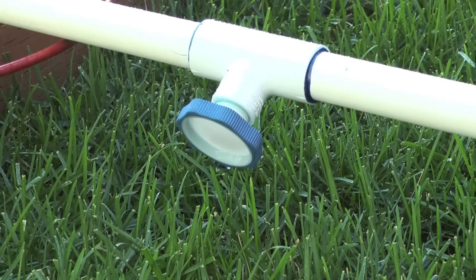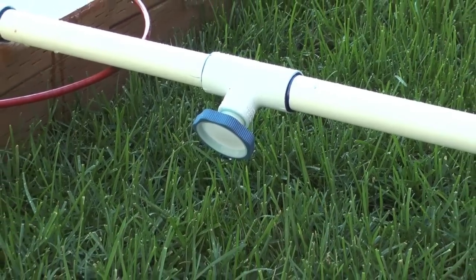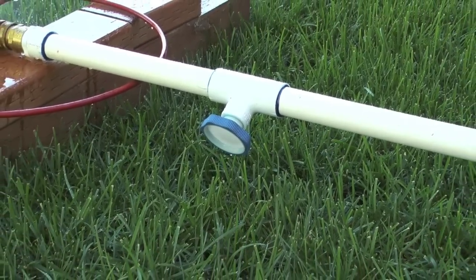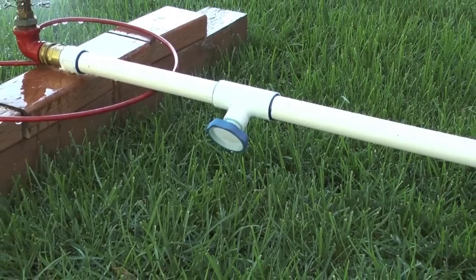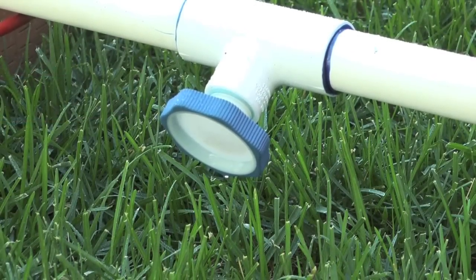As you can see, this is a very efficient way to protect the sprinkler system from frost damage. These drains can be used at the low points on zone lines, and I also like to use them in manifolds so that when the sprinkler system is shut off in the fall, the drain opens up and drains the water out, thereby protecting your sprinkler system.